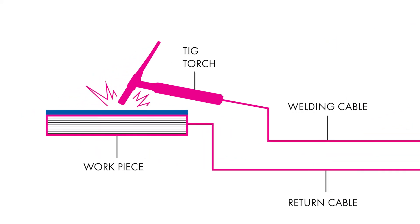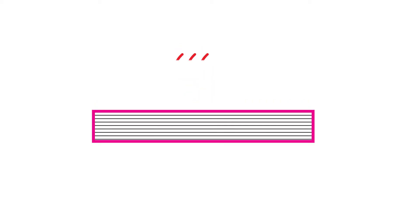Another way to penetrate the aluminum oxide layer is to weld using an alternating current, or AC. During this process, there is a change between positive and negative half waves. The oxide layer is broken up with the positive half wave, while the penetration into the base metal is achieved with the negative half wave. Another way is to use AC welding with a pulse frequency to add to the cleaning of the oxide.